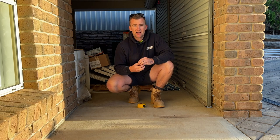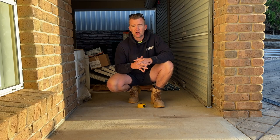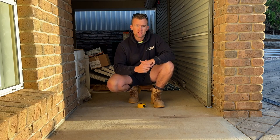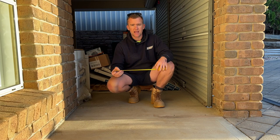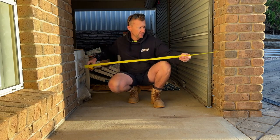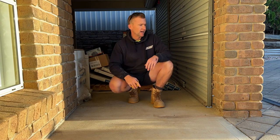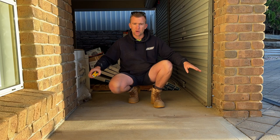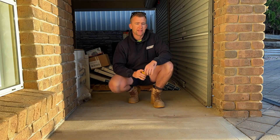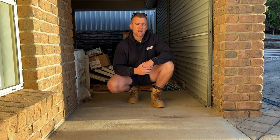In my experience and advice, just measure it a few times and calculate it a few times to make sure your gate's going to be perfect when it arrives. When you install this gate, it's going to be super easy. What you want to do is measure in between the bricks. Keep in mind some bricks might poke out more than others, so take a few measurements from the bottom working your way up. Find the smallest measurement in between the bricks and use that.